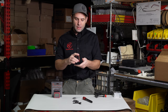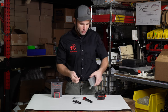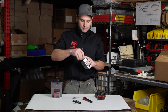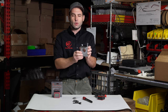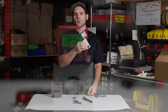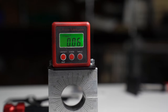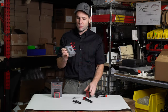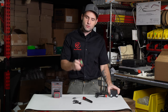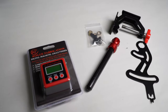The other way you can use it, also included in the kit, is this little funny duck bill looking thing. I'll show you what it's for. You put it on the top of one of the clamp blocks that go on the bender — this is what holds the tube in the machine while you're bending. As it's bending, you can use this to read your bend angle, which is really a duplication of the angle indicator already in the machine. You could also use this to measure rotation. The clamp block is also lasered to measure rotation, so there are a few ways to do it. These cubes are accurate to within a fifth of a degree with a resolution of a twentieth of a degree, so they're highly precise.